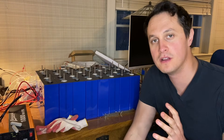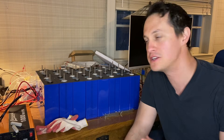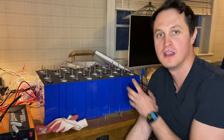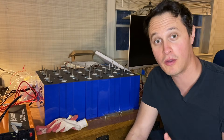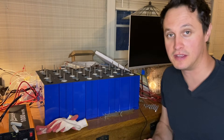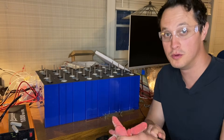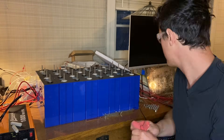Tonight I'm going to show you how to assemble a 48-volt battery from start to finish, including wiring everything in series and then hooking up the BMS. First thing we're going to need is safety — that means glasses, gloves, and remove any jewelry before you get started.